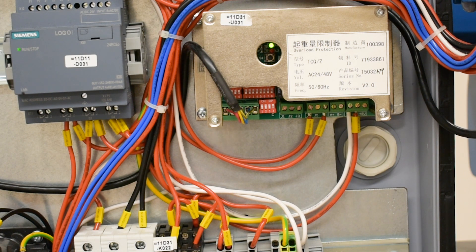If red is on and green is flashing, you may have the wrong dip switch setting. If they're both flashing at the same time, you could have a broken sensor wire or a wrong connection. If the red flashes and the green stays off, that indicates an internal fault in the self-check — change the device. If they flash alternately, it is conducting an internal self-test during that time.